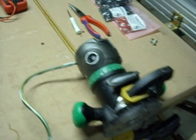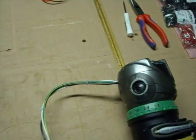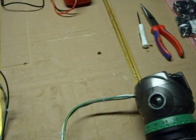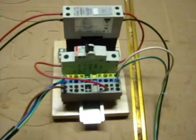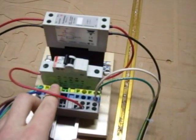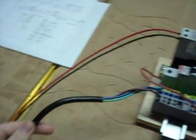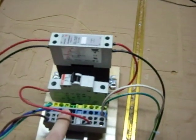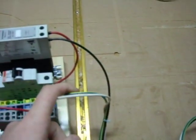Basically what I did was I took the router apart and disconnected the three leads coming from the multi-core cable. For the purpose of this test, I just ran individual leads to my little AC bus here. You've got your line, neutral, and PE. In the terminals I've got my input — 120 volt nominal power — with line, neutral, and PE. PE and neutral go directly to the router.